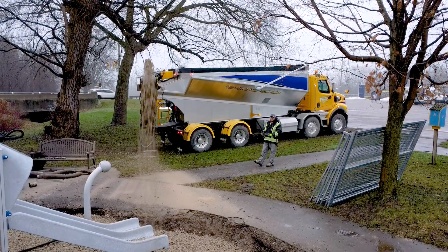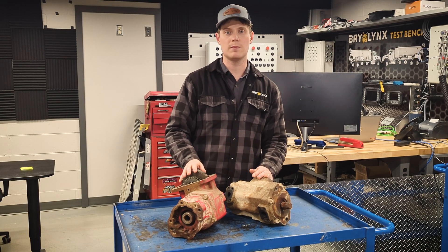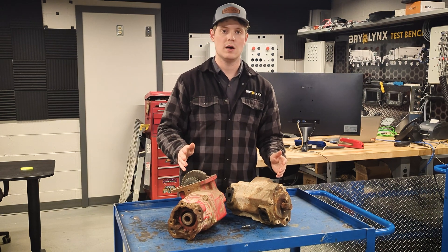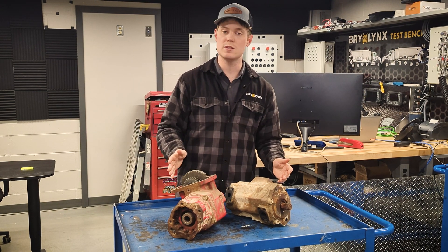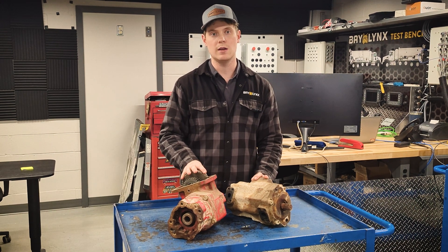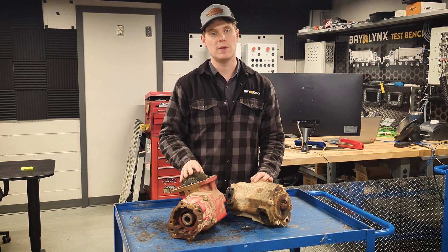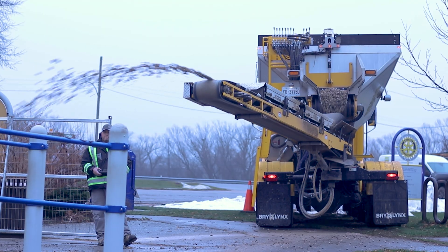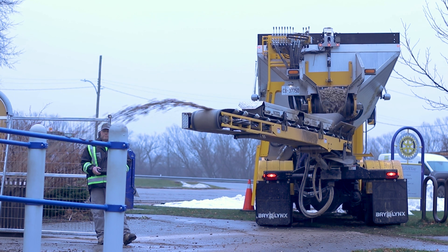Pumps and PTOs are something a lot of people don't think about. It doesn't come to mind to maintain them or grease them. Oftentimes guys will go months and months without ever greasing them, but it's something that's highly recommended by each manufacturer. They all have their own time frames and you should make sure that you separate them from time to time to grease your input and output shafts.